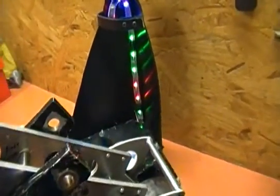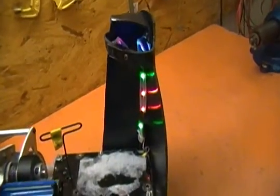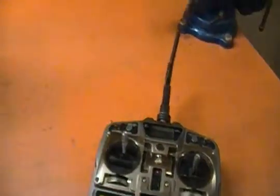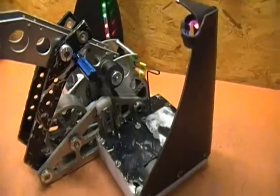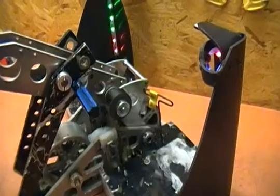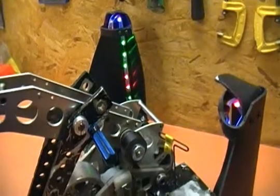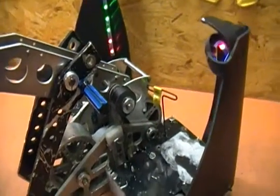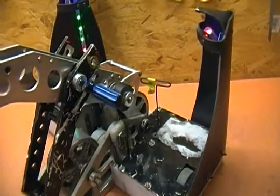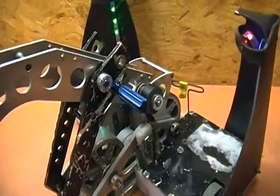Okay, so in diagnostic mode I just switch the LEDs to groups of 3 as they go on the strips. And while I'm in this mode, playing with the throttle actually doesn't do anything in the robot. If you could see the Arduino inside, I'm actually piping the throttle to the blink speed of the LED on the Arduino. I decided not to do it to the big strips because that would be a terrible strobe effect while I'm trying to work. It's nice and stable. While it's in this mode, the weapon system is completely normal, except that there's no throttle spinning. This allows me to test things like the bump sensor.